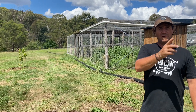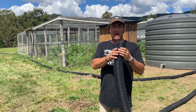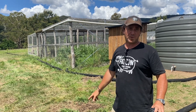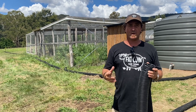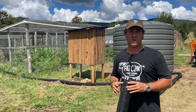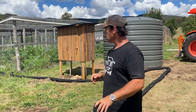I'm hoping that not only will we have the overflow running through, but in really wet events where I get too much water, this subterranean pipe will capture some of that runoff and push the water toward a slight ridge where we've been planting a lot of olive trees. So it's a two-pronged attack: taking the overflow and using it as irrigation, but if it gets too much, it takes the water away as drainage.